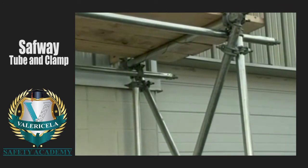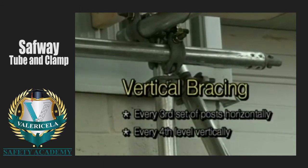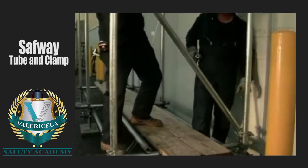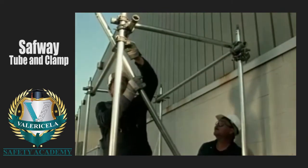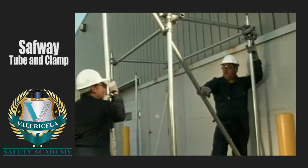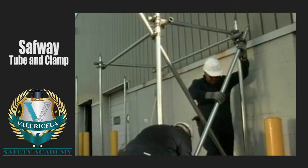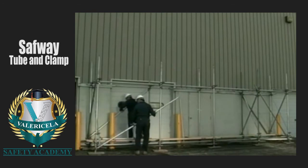The next step is to install vertical bracing across the width of the scaffold at both ends, or at least every third set of posts along its length, and every fourth level vertically. This is done by installing a brace diagonally from the bottom outer runner near the end post upward to the next inner runner. Right-angle clamps are used for fastening these braces to the runners. Install a second brace in the same manner, but in the opposite direction to form an X. Swivel clamps may be used if the braces are clamped to the post. All bracing should be installed as the scaffold structure rises.